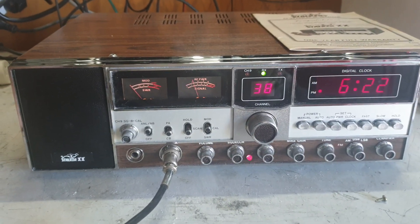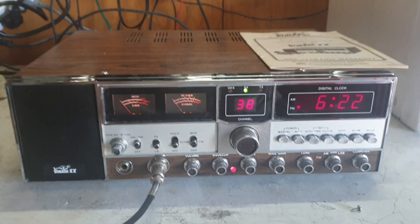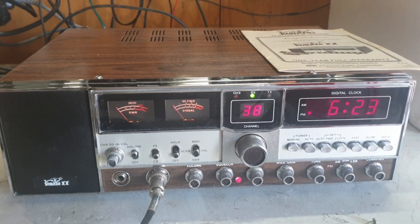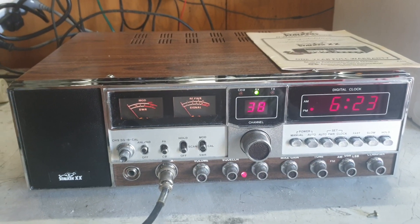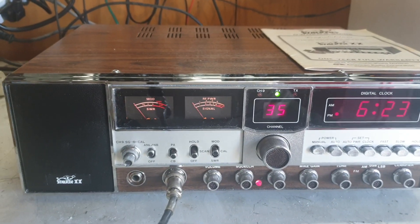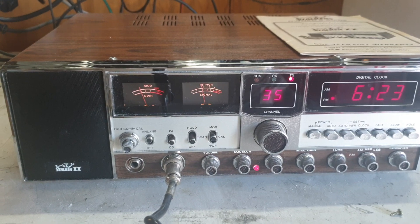Texas booming in there! I won't even try to go back to those guys because they're not going to hear us on the small antenna we're on. It's a really beautiful radio. Anybody hearing us at all? My SWR's a little bit up on this one — it's actually the antenna set more for 10 meters, still shouldn't be too bad, about 1.7 or something. This is 2-2-9 testing, one two three four five.